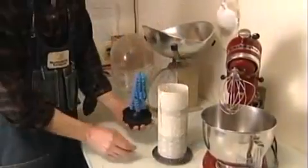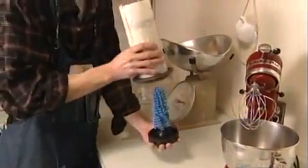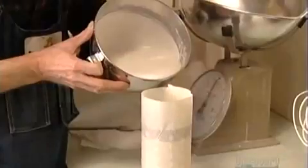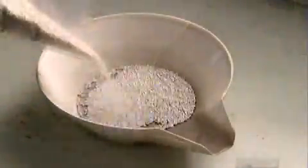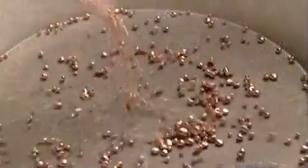Then they place the tree in a perforated steel flask, covered in masking tape. They pour in a liter of plaster, which hardens around the tree. Then they remove the tape and heat the flask. The wax melts through the holes, leaving plaster cavities in the shape of the key parts.